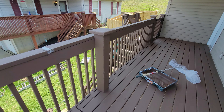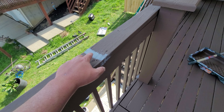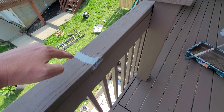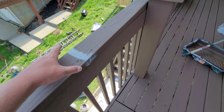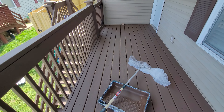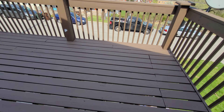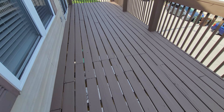Railing systems are all done. Silverback epoxy here in between boards to prevent water from penetrating down in there, filling that out and stopping rot. Super pretty, super gorgeous deck system — very happy with how it's turning out.